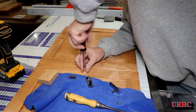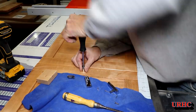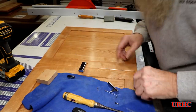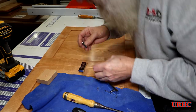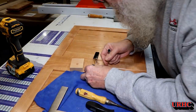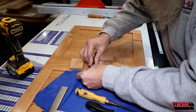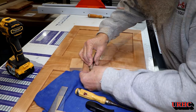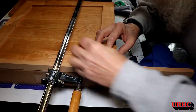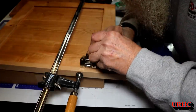The first piece of the handle screws in through the center — it's hollow, with a V to lock the other piece in with two tabs, and the other piece just locks right onto it. Then there's a tiny set screw in the side that locks into the V on the post in the door, locking the handles in place. They really did work out well for handles and they match everything else in the room. Now it's time to rough-mount the hinges.